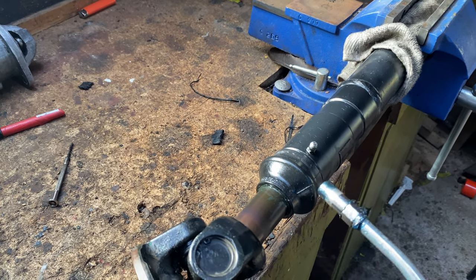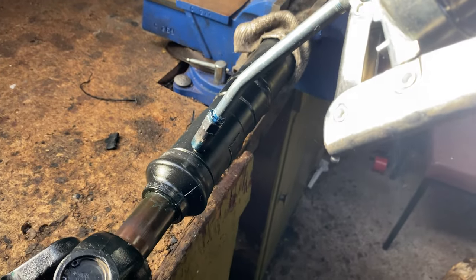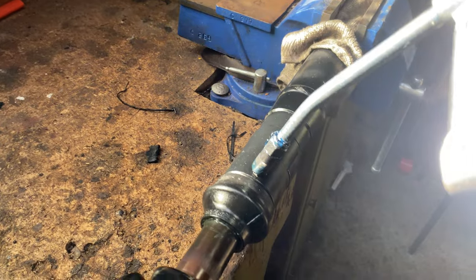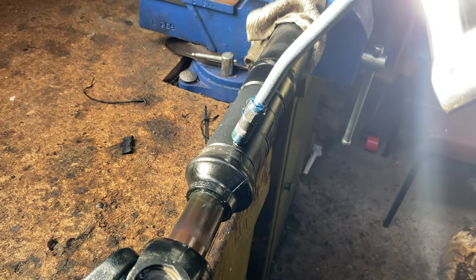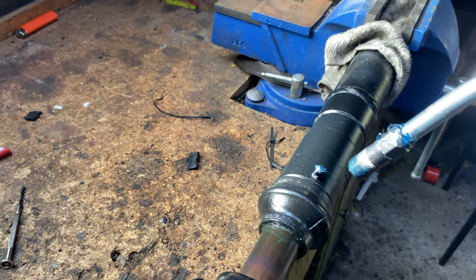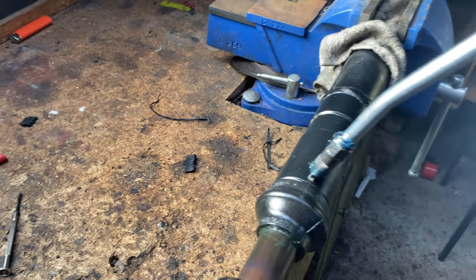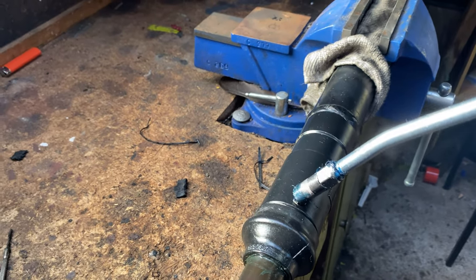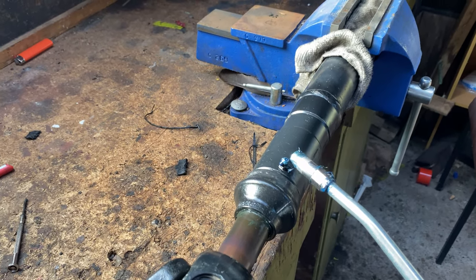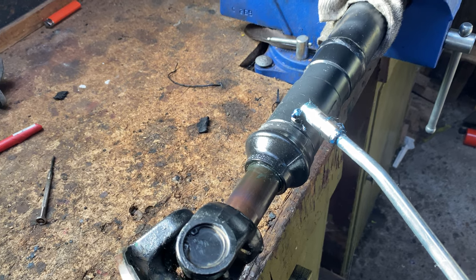It's really important to grease the spline — I'll show you why in a second. When you've finished greasing and you want to get the grease gun off, the correct way is not just pulling it. The correct way is to push down and twist — it comes straight off. When you pull it, you can actually snap these nipples. Another way is to put it on, push down, and roll. It's just a little technique to get it off easily and safely without snapping them. They are replaceable — you can keep some spares; they just screw in and there's a little nut so you can get a spanner onto it.